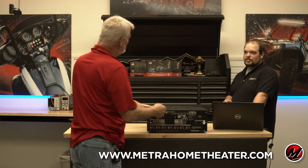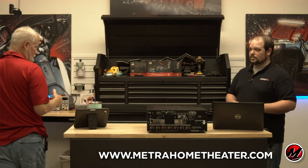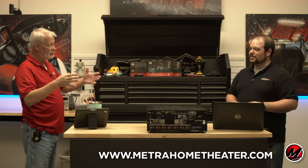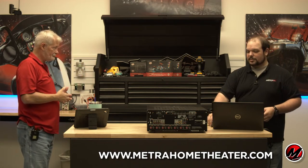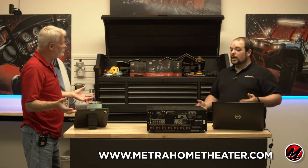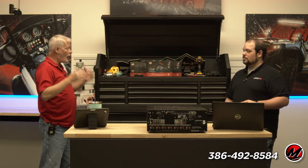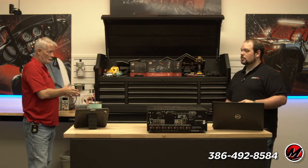You can get into an AVR for less money than a standalone pre-pro, but you may also have a good quality multi-channel amp you want to run off of it. For years my Denon ran my Parasound amp instead of using the internal amp. You can pick and choose the amplifier you want — it's actually easier to hear audible gains or improvements with a separate amp than with a pre-pro.